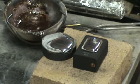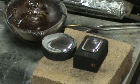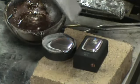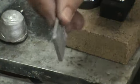Because this is pure tin, it melts at a lower temperature. We're just doing this for demonstration purposes. I'm going to let that cool off. But you can see, when you pour an open mold, it makes the top rounded because of the surface tension of the metal — just like when you put water into a glass and it appears to go up higher than the edge. That's due to the surface tension. If you want a flat ingot, like this one, this ingot was poured in a two-piece mold.